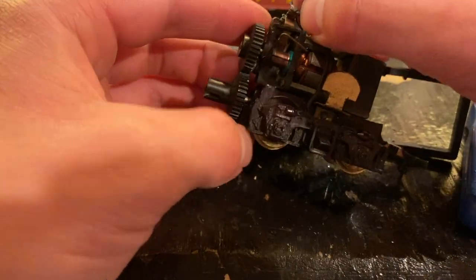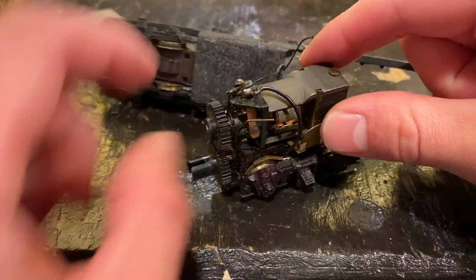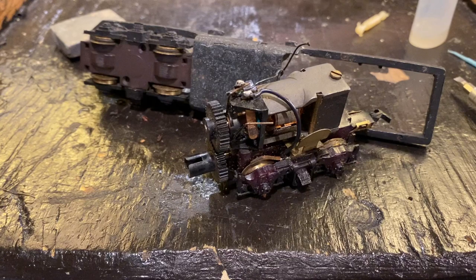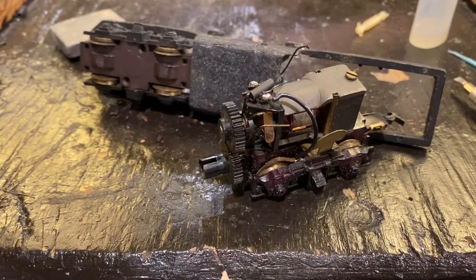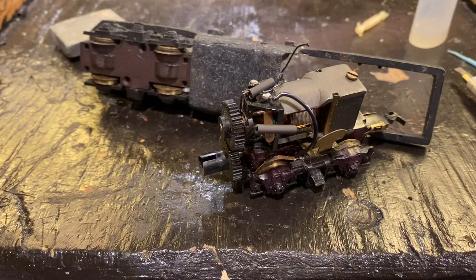Overall this motor looks to be in fine shape — I think it was just the lack of oil and everything else that was really preventing this thing from going. Let me just get something to clean out the gaps. This whole thing really just doesn't seem that bad. I think we're okay to put the brush and everything back in. It looks like I somehow took the insulation off both sides of the V-spring right here. I don't know exactly how I did that — they might have just been so brittle that they just cracked right off. Either way, those need to be replaced.